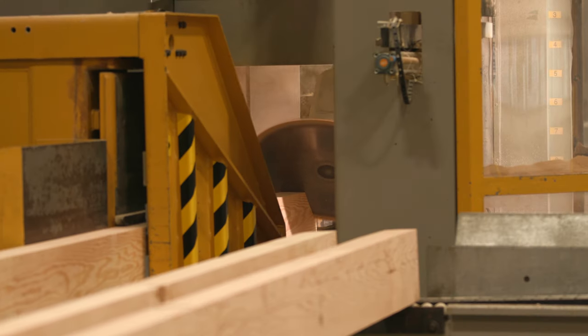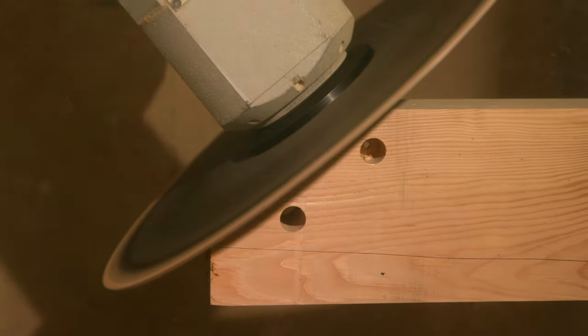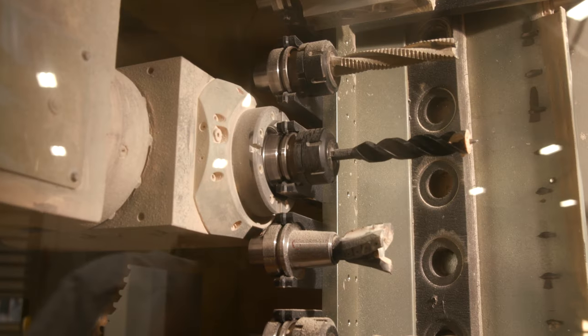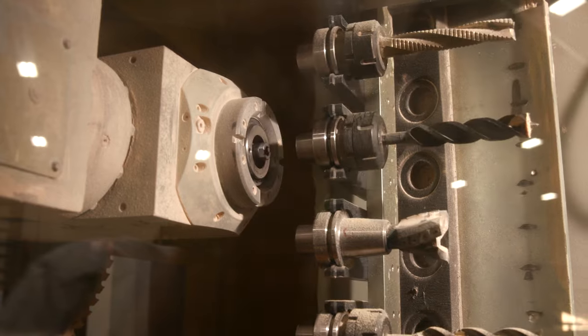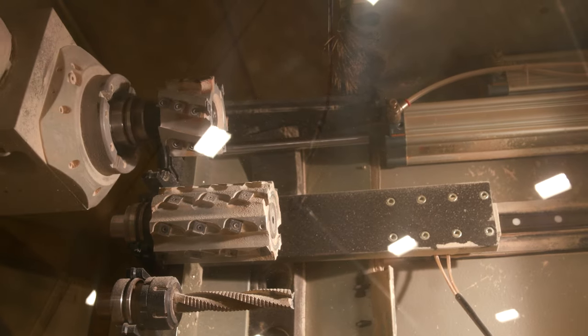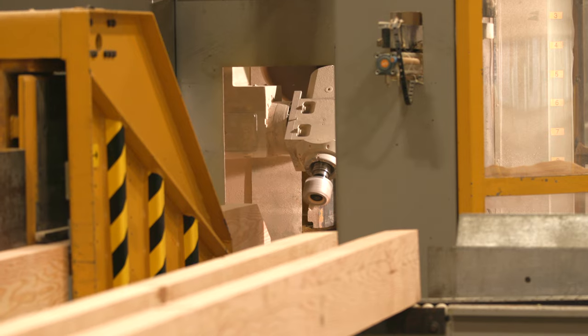There's over 400 parts of this build, and each piece is being cut on the CNC machine, as you can see behind me. It's a five-axis machine, so it can cut the timber on all five sides. The machine is equipped with an automatic tool changer, and it automatically grabs the correct tool for the specific process